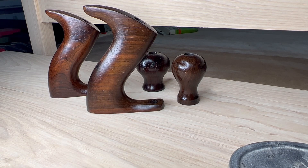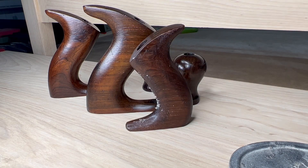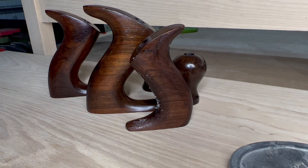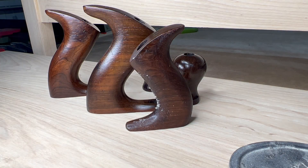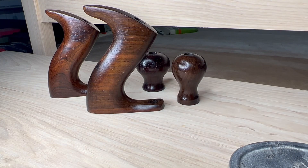What I do differently — maybe I do it different, maybe you do this too — here's my tip: the manufacturer will recommend that you apply a paste wax and let it dry. So here we have a little number two coated in wax. If you see it in terms of the light, there's no sheen, no shine — it's got a really dull finish because I put it on hours ago. My point is: let it dry. Don't do wax on, wax off. If you put it on, smear it around, wait a few minutes, then hit it with your cotton shirt.